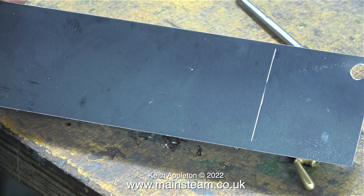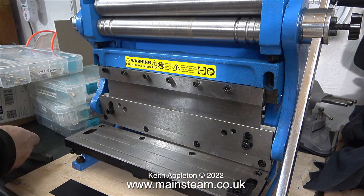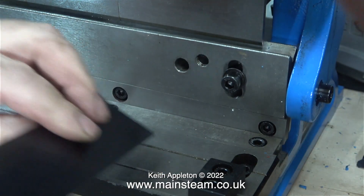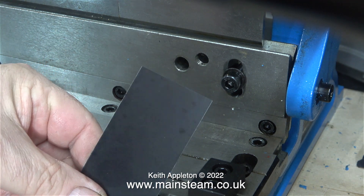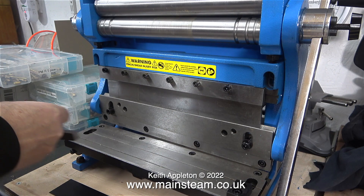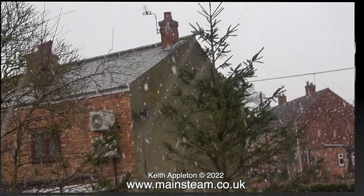Once upon a time this anodized metal from Stuart Models was made from steel and it was a lot stronger. This aluminum is very soft and marks really easily. This is a Clark metal worker — a very useful tool to have in the workshop — and at the bottom it has a guillotine. I removed the guide that normally covers the blade so I could see what I was doing and so I didn't mark the metal. This small guillotine cut the metal perfectly. It's important to make sure that the blade is properly adjusted — it wasn't originally when I first received the machine, but now it's fine — and I'm putting the guard back in place.